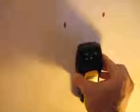Again, I fortunately have these little drywall screw marks as a guide, but I want to verify that there is indeed a stud there. So I have my little stud finder. I turn it on, and I move slowly, and there it is. Right about there is my stud, and I'm going to mark right there. And just to verify the other side, indeed. So I do have a stud right there, and my little hole is kind of centered. That's where my stud is.